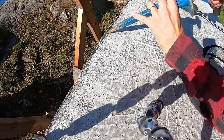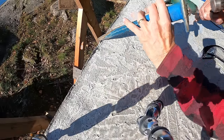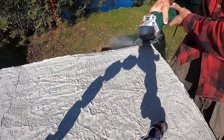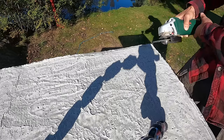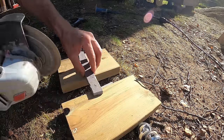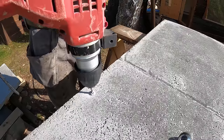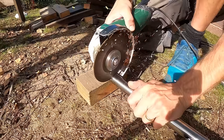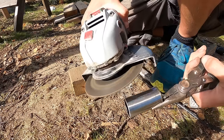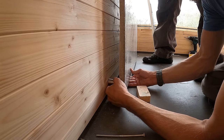According to fireplace regulations, you need some protection. I made this 1-inch concrete plate the same way as the plate for the oven. The Norwegian regulation says something like minimum 2 inches from non-burning material, i.e. concrete, to an oven placed in the open. In addition to this, I also used 2 inches from the wall to the plate because it looks good and it is even more secure. It's tried and tested and it works great.